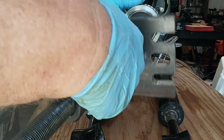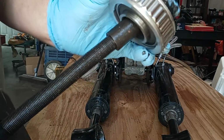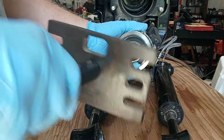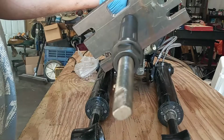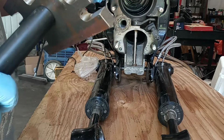There's a little slot right here. You can reach in there with a screwdriver, kick that foot over, and it catches the back of that bearing like that. And then as it's in there, you screw this part. It's got a little bearing in here, and it pulls that shaft and it'll pull that bearing right out of there. A piece of cake.